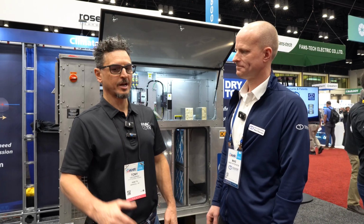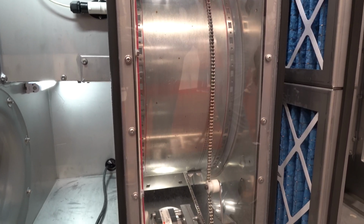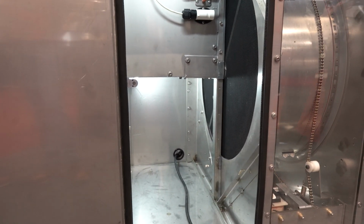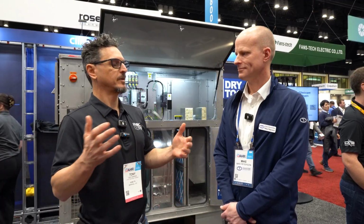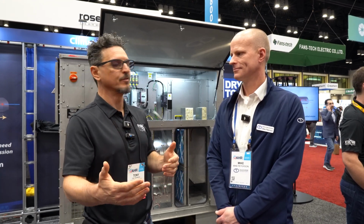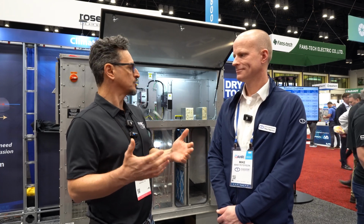That's right. So one side gets heated, comes out of this unit very hot and full of humidity, kind of like a dryer vent. And then the other side gets very dry. Now, we're talking about drying air in typical dehumidification. We're taking air at 80 dry bulb, 67 wet bulb, and bringing that down to the low 50s maybe, which is about a 50-degree dew point.